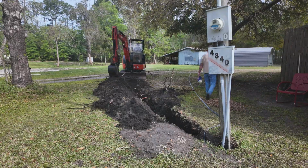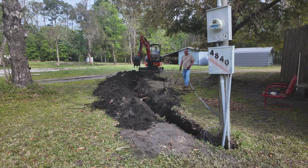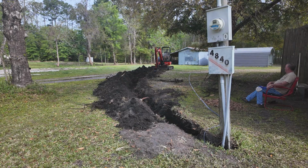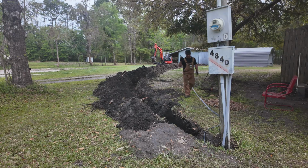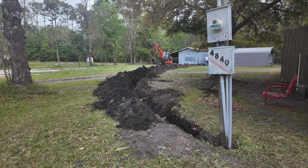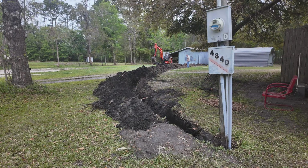You have a lot of blind spots on the side, and it's something that you have to warn people around. Many people die every year because they get hit by a loader or some sort of heavy machinery because people just can't see it. And you're paying attention to one thing, and you're not paying attention to the people around you, your surroundings. It's very important to be aware of what's around. So always walk it around, understand your surroundings.